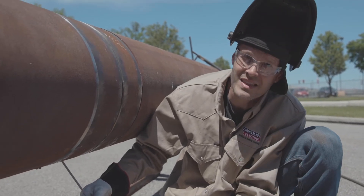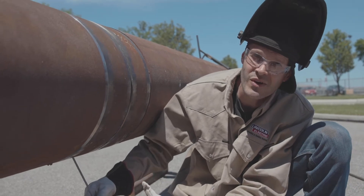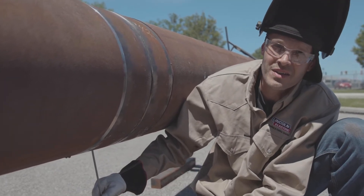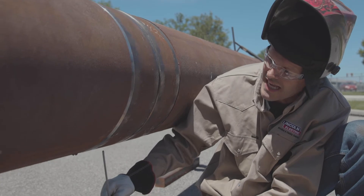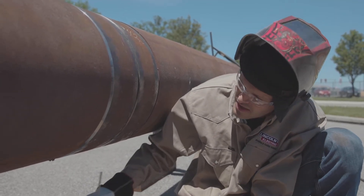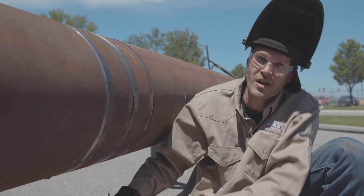So I'm going to push across the bottom. While pushing across the bottom, a big thing I'm looking for is buckshot coming out. If your rod angle is not right, you're going to get a lot of buckshot and spatter coming down on you. If you see that, read the puddle and adjust your rod angle. Another thing you want to avoid is stepping — you don't want to whip the bottom. You want to do just straight nice smooth stringers coming across the bottom. Let's fire off and I'll show you what I mean.